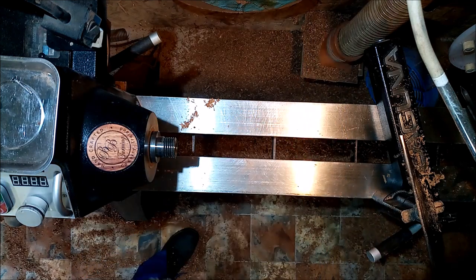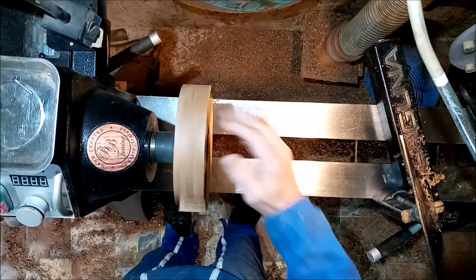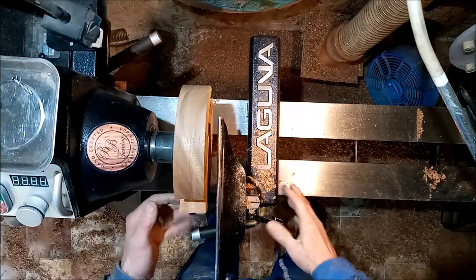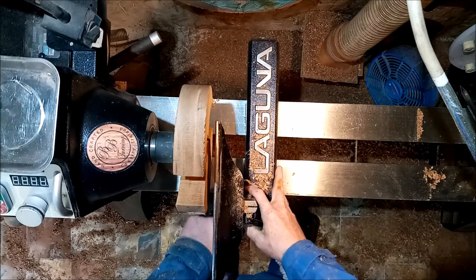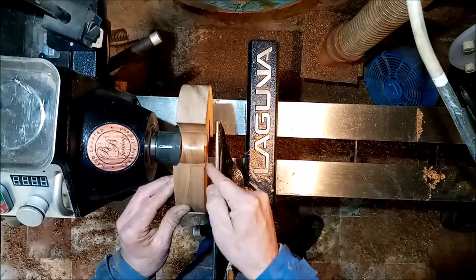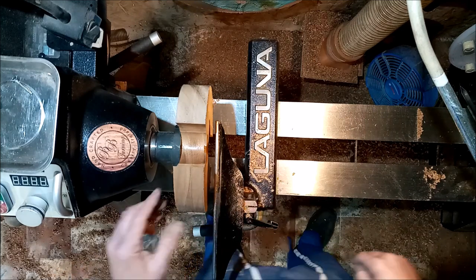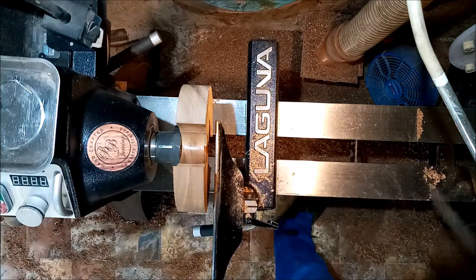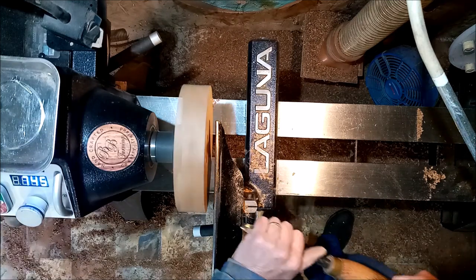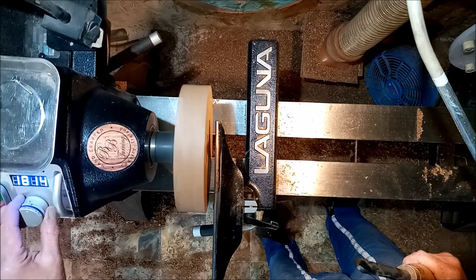Now back onto the lathe with it. Yeah, that didn't go too bad, I think. Now what you want to do is turn the outside of your bowl. What you're looking for is a shallow bowl coming from the middle out. You don't want any straightness here. You want it literally coming like that out. Now, as with a winged bowl, speed is your friend here.